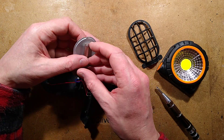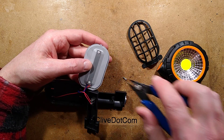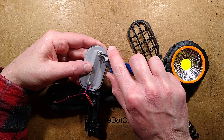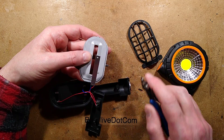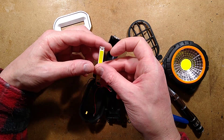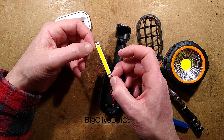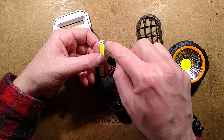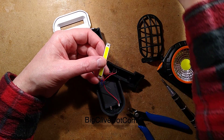I can give you the dimensions - let's pop that out. It's heat-staked onto the plastic. That metallised-looking reflector is just a sort of metal spray. The COB has two connections going on one end, a couple of small holes for mounting - that's what the heat stakes were - and the same connections going out the other end. That is fairly common.